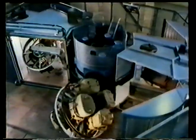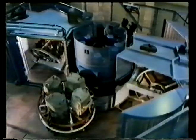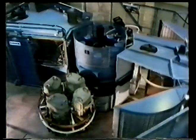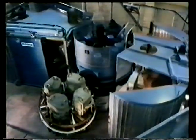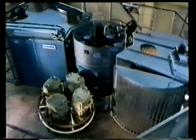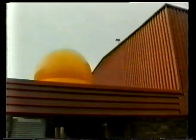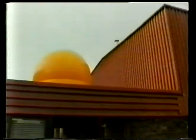As the mold heats up in the oven, the polymer plasticizes. The constant rotation of the mold ensures a consistent wall thickness. Many kinds of objects can be made with this process, ranging from vehicle air ducts to specialized toilet accessories, small items like traffic bollards, and very large objects, such as this 700-gallon water tank designed for the Middle East.